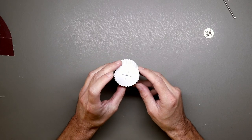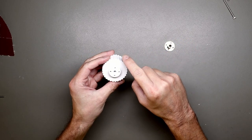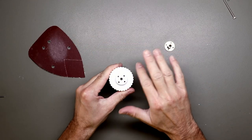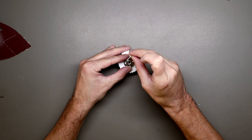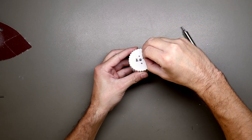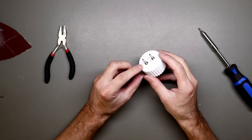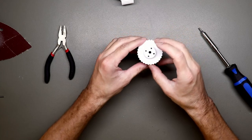The next thing we need to do is to assemble the little wheels that will accelerate the ball. And we need to put on this motor mount. But first we need to sand this a little bit so it's smoother. I have 240 grit sandpaper. So that should be enough. And then we take some M3 screws. And now we need to add the washer and the nut. The only screws I had left were these slightly longer ones here, but I will cut them later with my Dremel tool. And now we need to do the same with the other wheel. And magic.